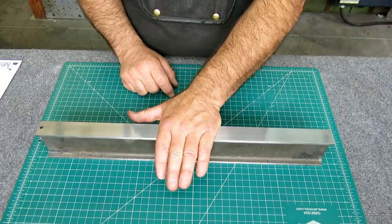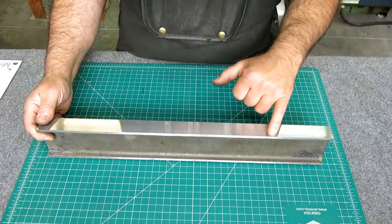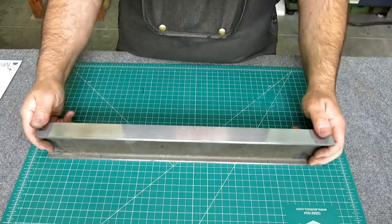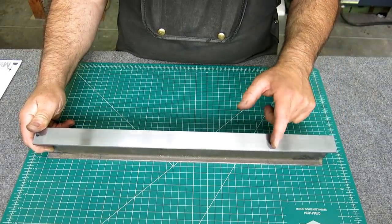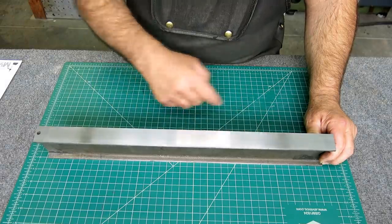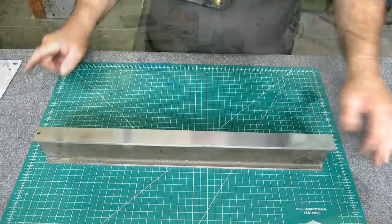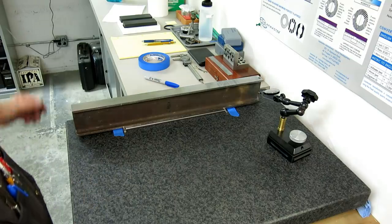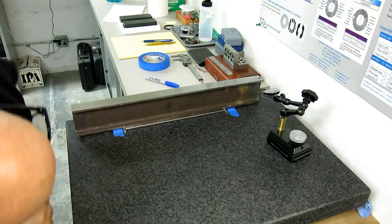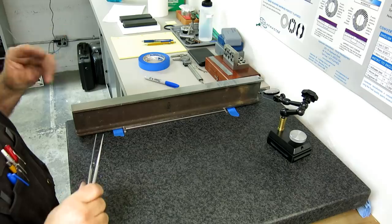You've got to be confident in your metrology that you're actually measuring what's there. It has to soak out and sit for a little while. So I'll do some lapping, then check it, let it sit for a while, and check it again — until I'm confident it's reached equilibrium. If I heat this in the middle here, this gets longer than it does at the ends. Let's go take a look at the measuring setup. Here's the measuring setup. What I want to point out is those marks — they're at about 0.5536 of the overall length. They're pretty close to what's called the Bessel points, but not quite. This is the minimum sag position.